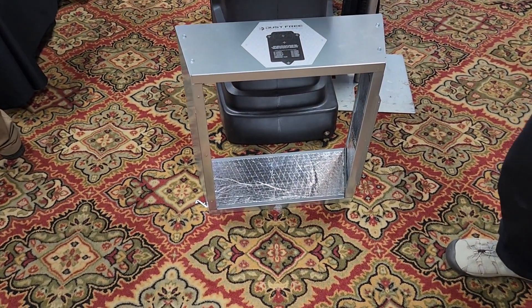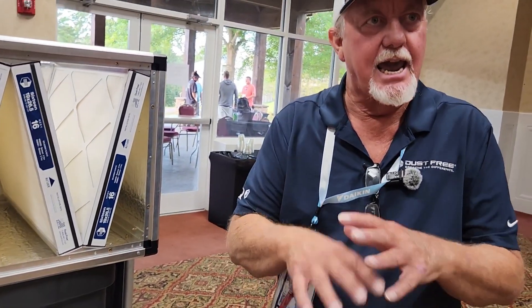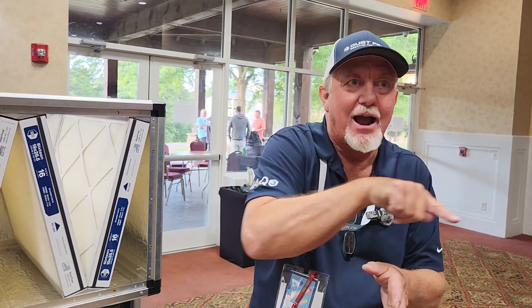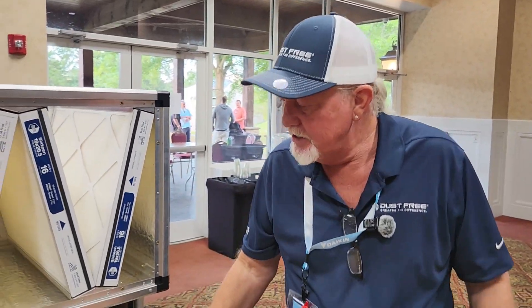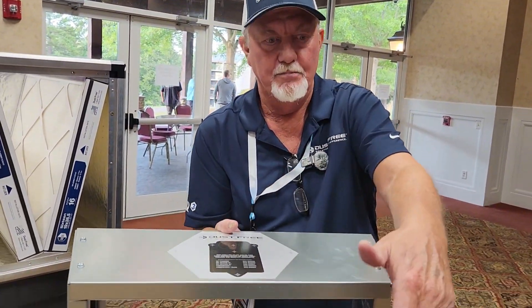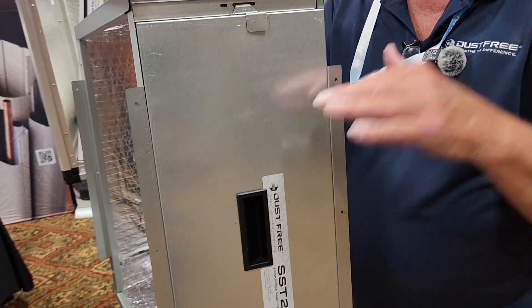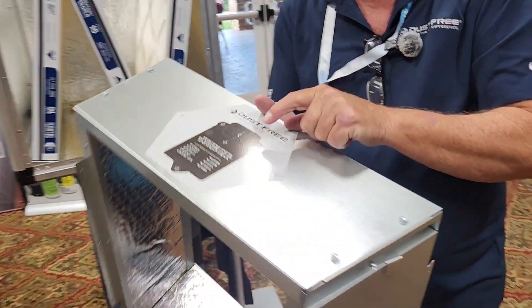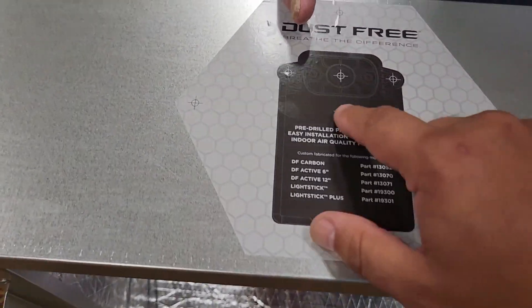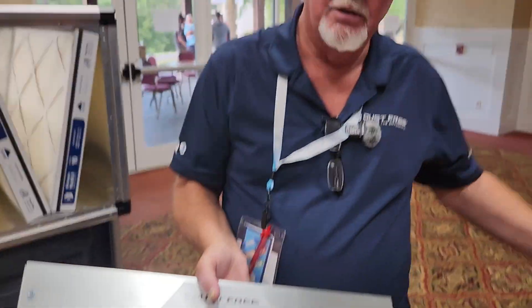Is this a transition kit right here? Yeah, this is an SST. We have several SKUs — A to A, A to B, A to C. What this was designed for is as we're heading into SEER 2 and EER and being able to do AHRI matchups on furnace and coils — we're finding that the coils are oversized. How many contractors have you seen smack them up and put a little L-bracket, taking away 30% of the capacity? So this transition is designed for SEER 2, maximum airflow, easy transition, furnace to coil. It's got an access door so you can clean the coil, inspect the heat exchanger and the coil. It's also got a mount for a UV light to properly protect the coil, and you can drill a static pressure port into it.